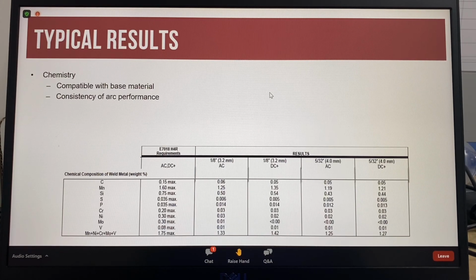If there are large variations in the chemical composition, but still within the accepted limits of the AWS specification, experienced welders will notice a difference in arc performance. Depending on manufacturing quality controls, it is possible for welders to notice differences in electrode arc characteristics, which can sometimes affect the procedure parameters between different batches of electrodes.